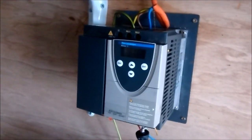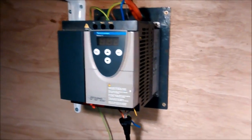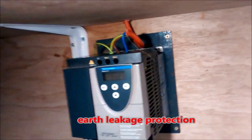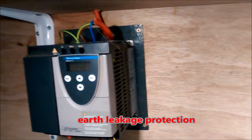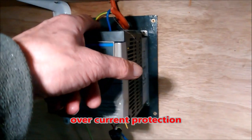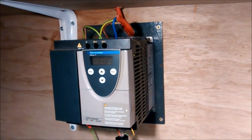Okay. Well, there are 2 bits of protection on the circuit breakers. One is for a fault, i.e. if there's anything which is connecting a live, or I presume even neutral, down to ground, or down to any other metal, and that would trip it. But the other protection is overload protection. That's if the current flowing between live and neutral is greater than the rating. It's not blown any fuses.